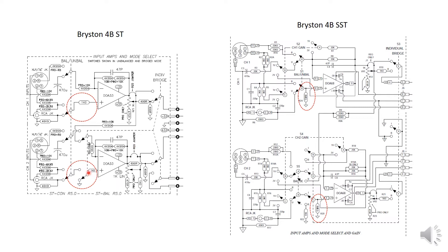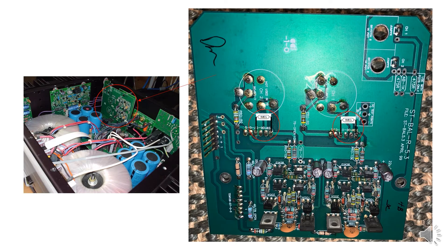This is a serious flaw and we need to correct it. The correction is relatively straightforward — you just solder a 1Mohm resistor on the positive input, located immediately at the input or before the 1Kohm resistor. That's fine. Find a place to tie it down to ground. If you look at the design physically, it's not a difficult job — it's quite straightforward.